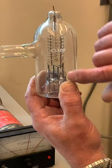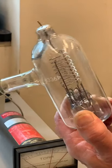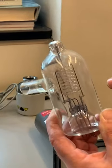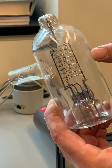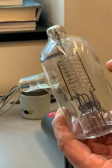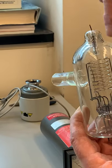There's a filament — that little loopy thing — and I run a current through it to make it hot so it starts emitting electrons. This spirally thing in the middle is called the grid. I set the voltages so that electrons coming off the filament are attracted to the grid and fly through the area in the middle.